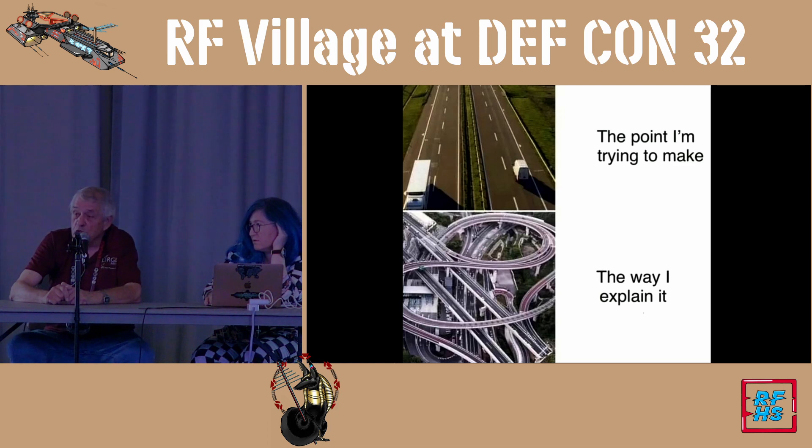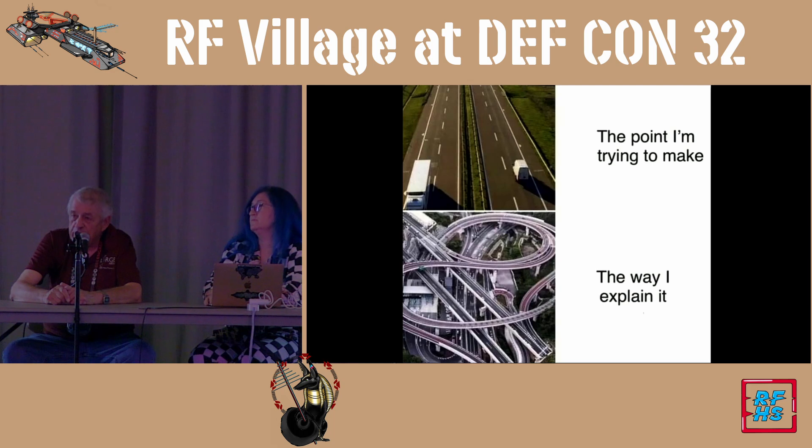What are they using for drone screening detection? I helped them do some antennas for one of the screening sections. They're using Chinese drones and putting 10 to 20 watt amplifiers on the video links so they can see them from a distance. I had a bunch of 5.8 GHz antennas left over from a plan to Wi-Fi the city of Plano. We put a 5.8 GHz antenna up in the air, put an amplifier to an audio amp, and when we hear a lot of buzzing coming, we know a drone is coming — we're listening to the 10 to 20 watt video links.